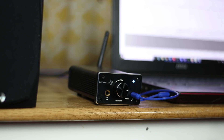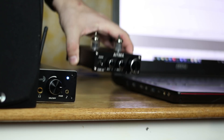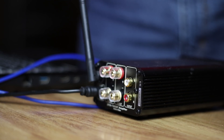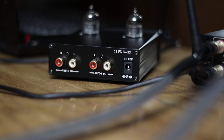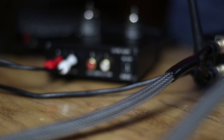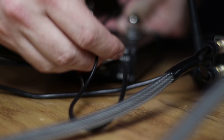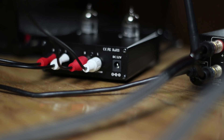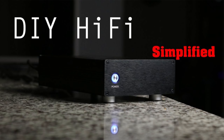Let's talk about why you might want a product like this. This is not a typical amplifier — this is a pre-amplifier, which means it goes before your amplifier. A typical amplifier will have speaker wire outputs on the back; this does not. It just has RCA — an RCA input and an RCA output. You're going to take your signal, whether it comes from a computer, your phone, a laptop, or even a television, plug it in here, then take the output and plug it into your amplifier — whether that's a little board amp or a DIY hi-fi amplifier.